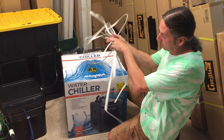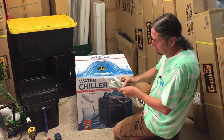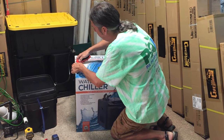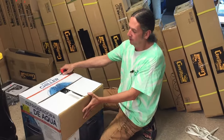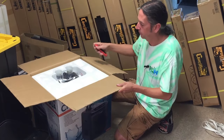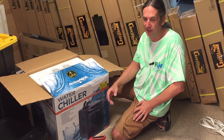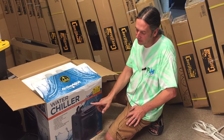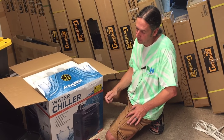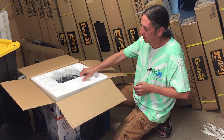I'm going to give Hydrofarm a shoutout here — this is the Active Aqua water chiller by Hydrofarm. They've been doing this stuff for over 40 years and they make some good chillers. What people don't know when they buy a chiller is you have to get other stuff too — it doesn't come with a water pump, so you'll need a pump and some tubing and possibly some fittings. This one is the quarter horsepower, and they recommend between a 400 gallon per hour and an 800 gallon per hour pump. If you ran only 100 gallons per hour through here, the water goes through the chiller so slowly that it'll be really cold but just won't work as well.